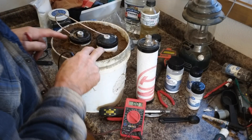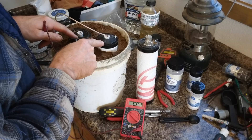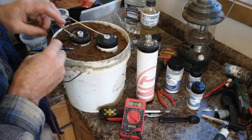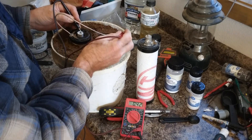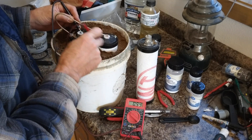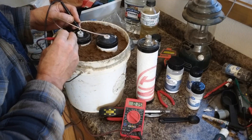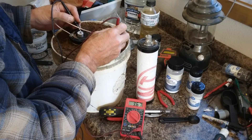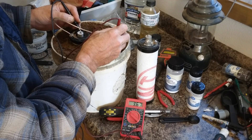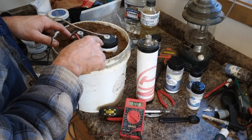This is just a bucket of moist dirt and sticking them in there, they're still electrically insulated from each other. Now I'll show you how the voltages stack up just like you would expect when you hook them in series. I've got the negative hooked to the positive here. Taking a reading from the negative and the positive — we've got 3.67 volts. So there's no shorting or loss of power in between them, even though they're both in this bucket of moist dirt.